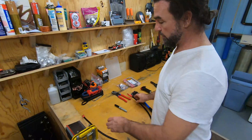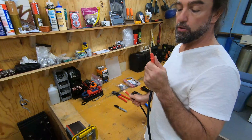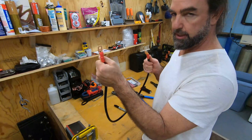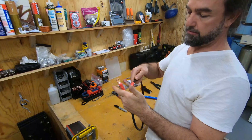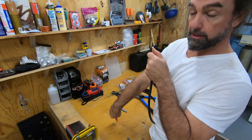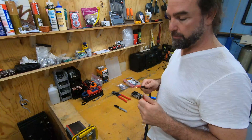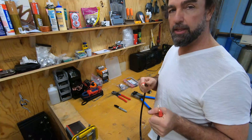I use this pilot here for marking the wire. One of the other things you're definitely going to want to think of when making these cables: connect one end, go over and emulate that you're going to connect it to whatever you're connecting it to, take the other end and run it to wherever you need to go. I went over and tested it three times — marked it with a pilot — because the lugs end up cross-eyed. This one connects one way, this one bends down and connects the other way. So trying to get this to bend the direction you want it to go after the lug has been placed is not going to be easy.